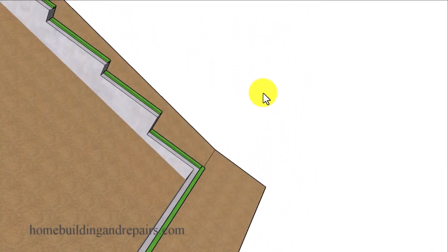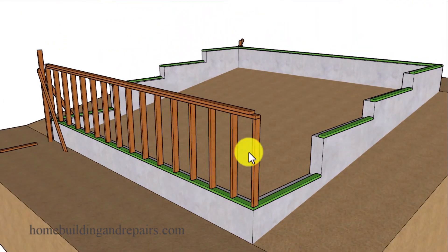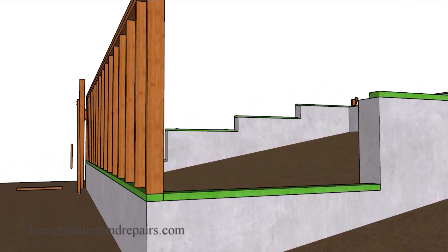You can then cut the rest of your framing studs and frame the lower wall. Once we have the height of this wall established and it's nice and straight, you can always install the batter boards on the other side and run a string line across both sides if you're worried about imperfections in the foundation. It sounds a little overkill, but this matters especially if someone else poured the concrete and you're doing the framing, due to imperfections in the form boards.